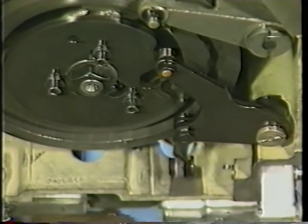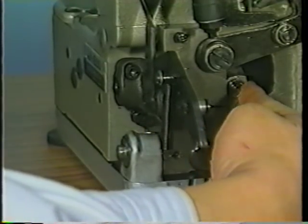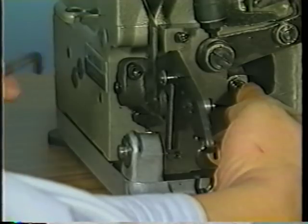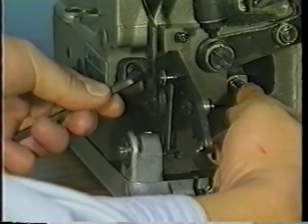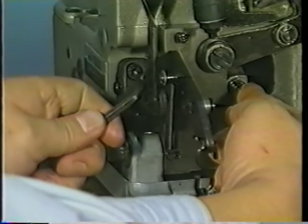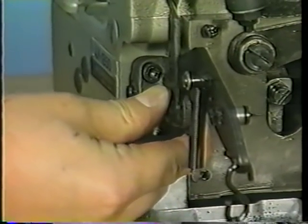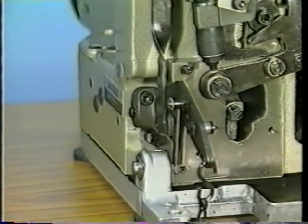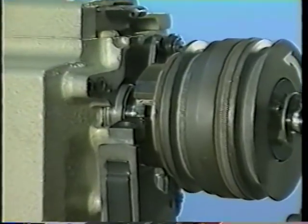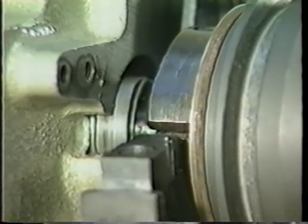When the stop motion regulating arm B is raised, the stop motion regulating cam will come in contact with the stop motion cam roller. Shifting the stop motion hook to the left, temporarily fix stop motion regulating arm J. Tighten the clamping screw while taking care not to provide play at the stop motion regulating arm and not to hinder the smooth operation of the arm. Adjust so that a clearance of 3 mm is provided between the stop motion hook and the stop motion cam.